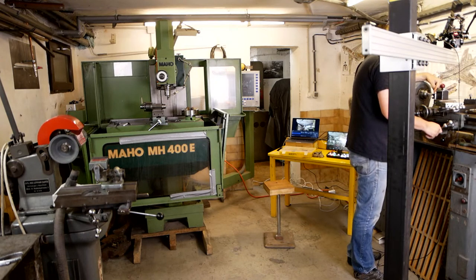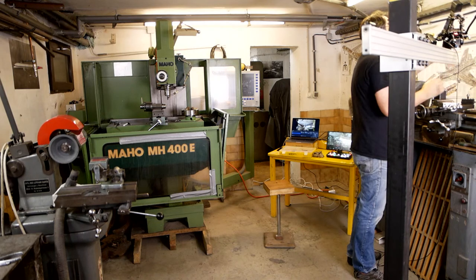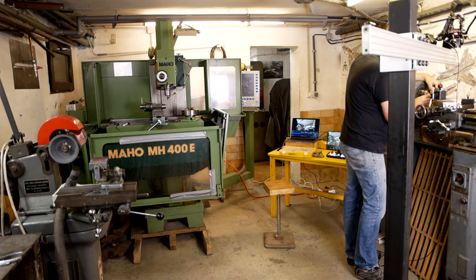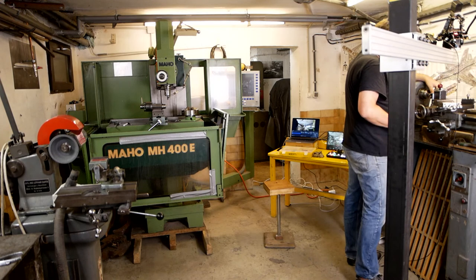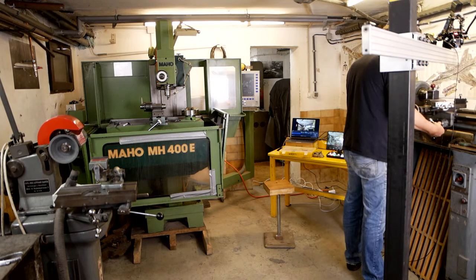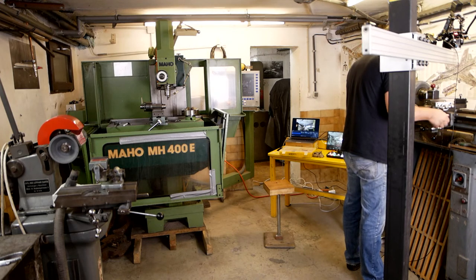This will probably be machined off anyway as part of the square, so it doesn't really matter, but I'll see if you can get in to see that better. Yeah, this from here to the tip is about 3/10 undersize. I'm not sure why. Okay, so that was a cut at 3/5 on the dial. So now I need to take 4/10.